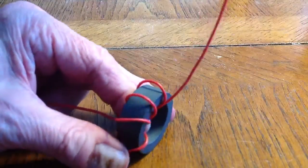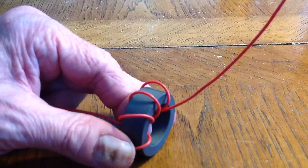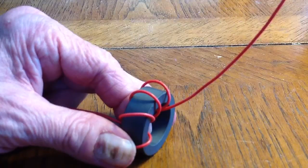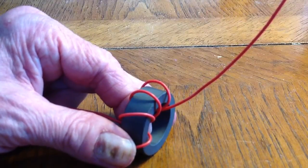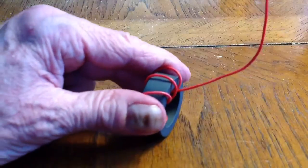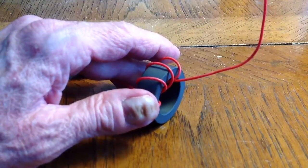So now I've got just a few turns. You don't need to wind the thing all the way around — it helps a little bit if you do. But if you only have four turns, as I do here, you don't have to wind it all the way around. It'll pretty much take care of itself, just as you don't have to wind a coil around a solenoidal core all the way from end to end.